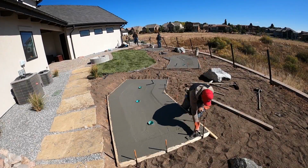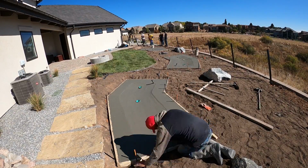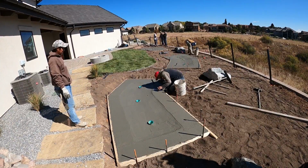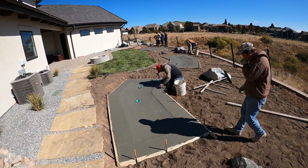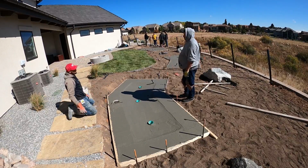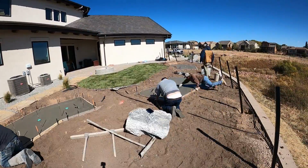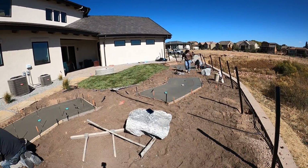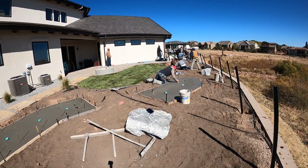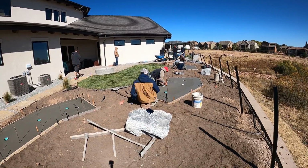And after we got about a foot of the perimeter completely flat, level, and the slope into those drains, I went around and put one rebar into the concrete every about 26 inches, 8 inches from the outer perimeter, just so when they laid their block for the planters, it would have a way to lock into the base that we poured. All in all, it was a great idea in my opinion what they did with these planters. I wish I could have had more hands-on with the prep myself, but we just got hired to do the pour, and I think it came out pretty good. And the guys over at Greenscapes actually did a pretty decent prep anyways, so I was glad that I didn't have to do too much work on the pouring side because they got their side done right.